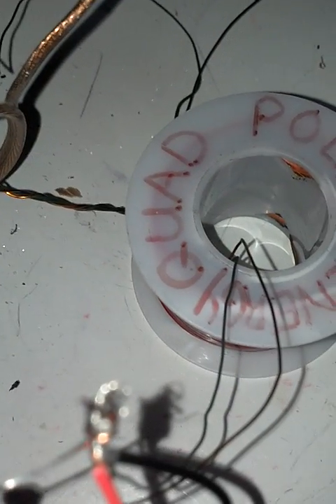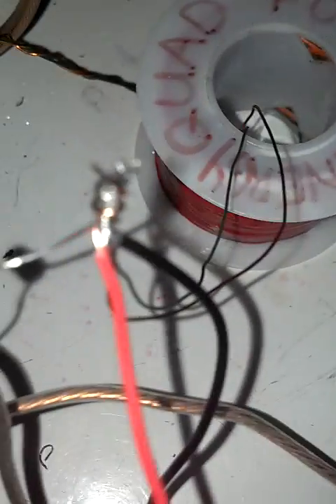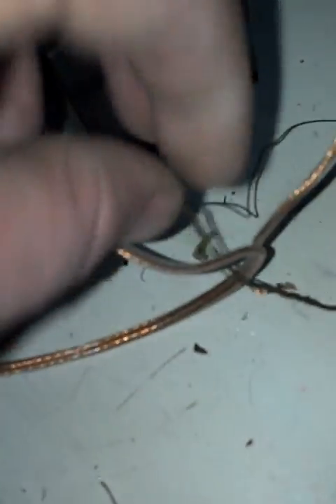We have all of the terminals on halfway up shorted, and this terminal right here is connected together as well, so we have no connection going to this wire right here. From here to here it's a dead short.